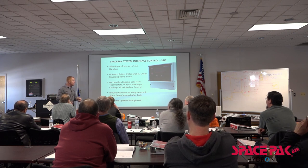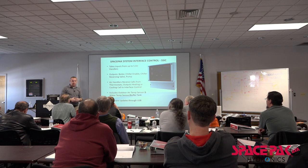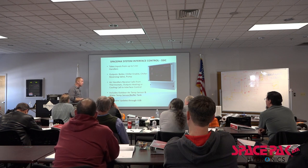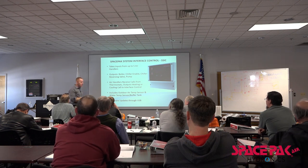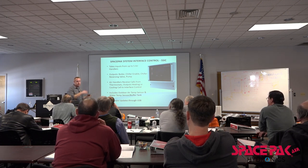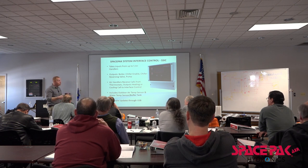So I went to him and said, listen, we need to open up some of the parameters on this, because I know our unit will make cold water at negative 20, but our control won't allow it. Oh, no problem. It's not something we're going to open up for everybody because you could get into a little bit of trouble if you press the button too many times. But knowing this was the application for it, I called Kevin Smart, who's our engineer in this department that handles this product. He updated the firmware and gave me a USB, I went up there and changed the program, and now the unit will run down to 20 degrees below zero safely. Right? So we're flexible like that.